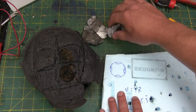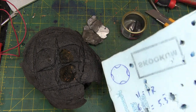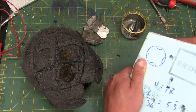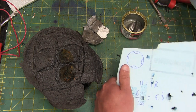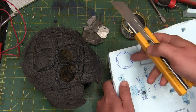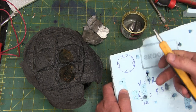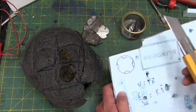We'll use a small tuna can as our crucible — this will be our refractory — and we might as well make something useful. I want a knob. So we're going to do this with the lost foam method. Essentially what happens is you put this in sand — very simple method. You pour in the molten aluminum and it burns out the form, and what you're left with is a solidified aluminum slab in the shape of the former styrofoam.